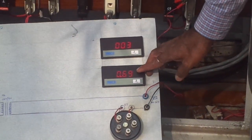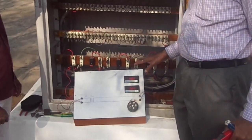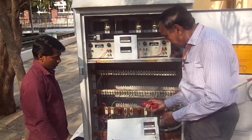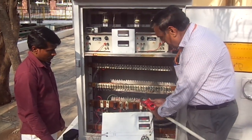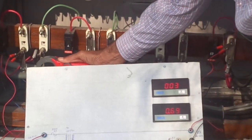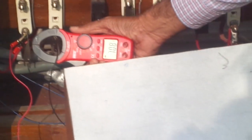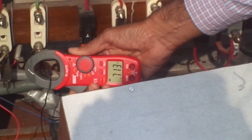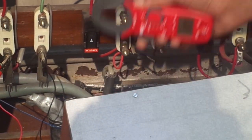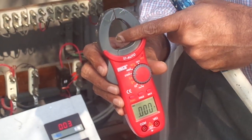For detection, you can give the 12-volt supply at the location box or at the TLGB. I am giving it at the location box only. Using this clip-on meter, we arrange the clamp meter in the 2-amp range. You can already see it is showing 690 milliamps. The same value will be reflected here — 690 to 700 milliamps. With this clamp we can read the wire current completely. We cannot clamp the complete rail, so we are providing the clamp meter only for the wheel flange wire.